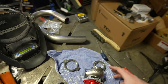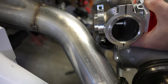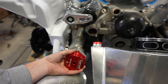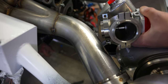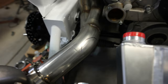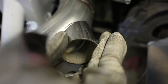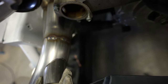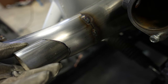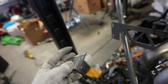Let's go ahead and get it assembled, cut that down, kind of hold it together with some tape, and see where we're at. Looking at this, I think I'm going to be pretty good with maybe about a half inch of straight pipe off of it. Welding the flange gains me the rest. You always cut it just a hair long too, because these actually have a receiver groove in it for the pipe, which is super nice — it makes welding it so much better. I think that's going to land really, really good for prioritizing the wastegate. One problem is there's a big old gap down below. I've got to be able to notch this up here and cope it. It sits nice along the pipe right in there, but this side I definitely need to do some work so this can sit down around the pipe and tighten up that bottom gap, and by tightening up the bottom one, that should help the top one.